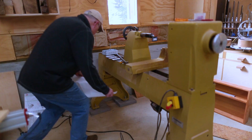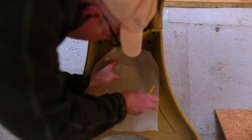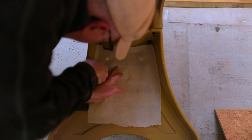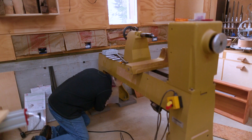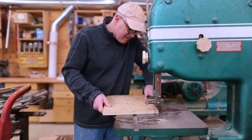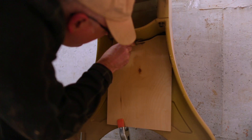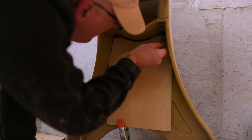When I started this thought process, I was going to put a junction box under the lathe here at the leg. The thought was to mount a piece of plywood to the leg, and to the plywood I could mount a junction box. So I need to fit a piece of plywood into the leg of the lathe and then bolt it to the threaded holes that are in the leg. I traced the shape I needed on a piece of paper, then scored those lines into a scrap piece of plywood, and cut that out on the bandsaw. Then I brought that piece back and clamped it in place. Now that it fits in the lathe, I thought I could scribe the edge and make the shape a little cleaner and closer to the shape of the leg.